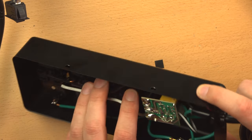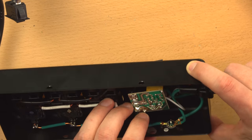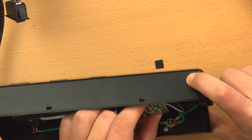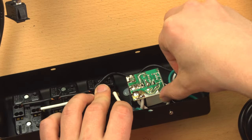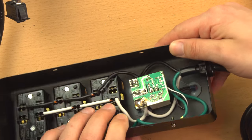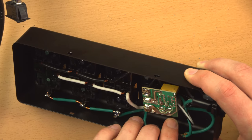just to have this thing end up melting the switch or something else happening to it that's unsavory. But I looked in the sides here as much as I could, and there's really only two major components to this. There's this small capacitor right there, which is probably just for high frequency noise filtering. And there's an inductor. I believe that's an inductor. The package is completely unlabeled, but it's white, and that's usually the type of package for inductors, which will help a little bit with filtering.